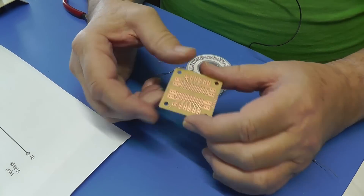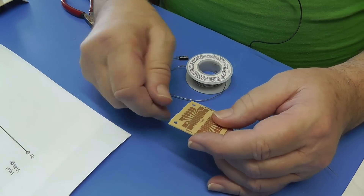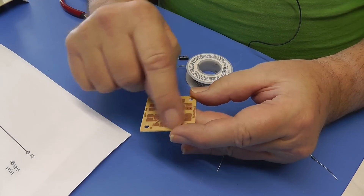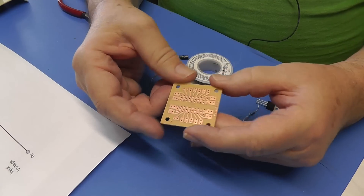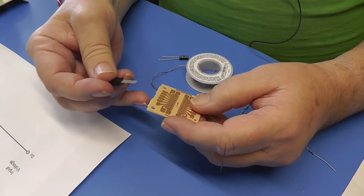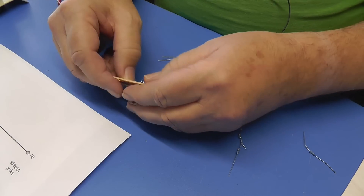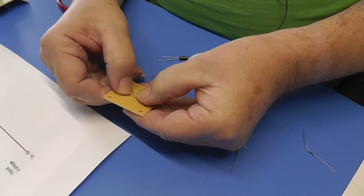This is what I've got for soldering on — it's a little Radio Shack thing. It comes with two of these; you break them apart. The idea is that you put an IC across here and then you can put other components out to the side. We're going to put this device right in the middle, because that way we can change it if we need to. I'm going to go on the bottom and bend these pins out a little bit.